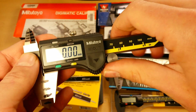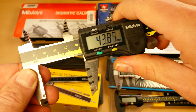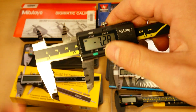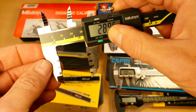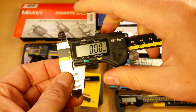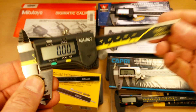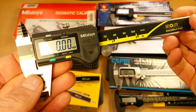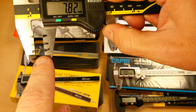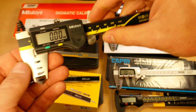The Mitutoyo is a great digital caliper. Its Absolute Origin means it always knows where it is in relationship to zero — it doesn't matter how fast you move it or where you come out to increment measurement. You can always come back to your absolute zero. There's no slop, no play. It's very well built to great tolerance factors and performs very well for accuracy and precision. The average variance between full-face measuring and the last data point was around half a thousandth. Now that's $120.